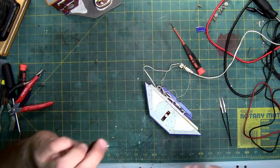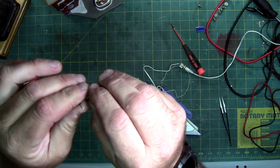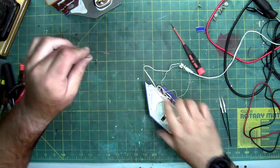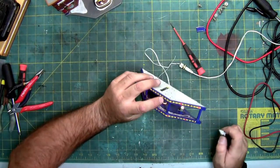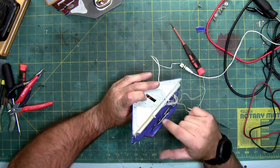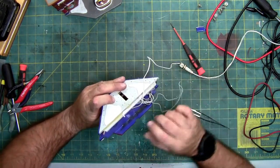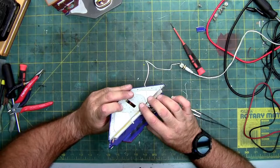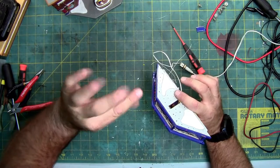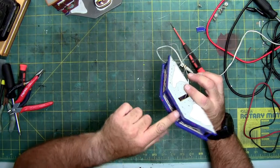So this is a little incandescent bulb and we have two wires and there's two solder balls and they're so close together they were arcing. I spread them apart to make them work, but in the process it cracked one of the solder joints. So if I press on the wire, the lights work. So I'm going to have to touch up the solder real quick to make these three lights right here function like they're supposed to. Somehow, in the expansion and contraction of the wires, they moved and touched each other, which is why I have three lights right here in the front that work intermittently.